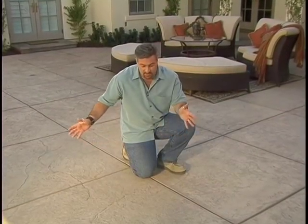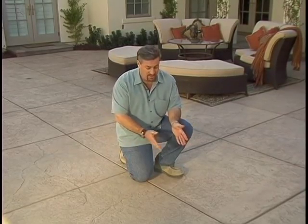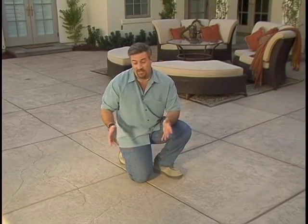In this case, we scored the concrete about four feet on center. Scoring means we cut marks or troweled in marks while the concrete was wet to allow the concrete to shrink and expand where we wanted it to, so that it cracks here instead of cracking at random.